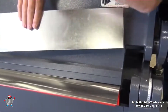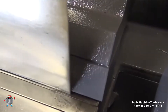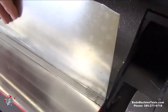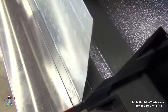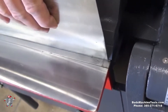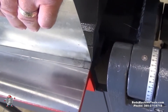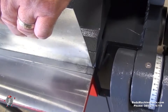So we're going to make an adjustment here. Right here is our bend line and this is the edge of our braking. We can see there's still a fair distance between the bend line and where the material thickness is at, so we're going to adjust that in to match our material thickness. Now we can see the bend line and material thickness — we need to go just a hair more. Now we're right there, so we'll screw down the lock screw so it can't move.